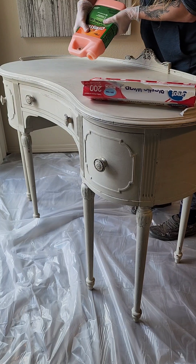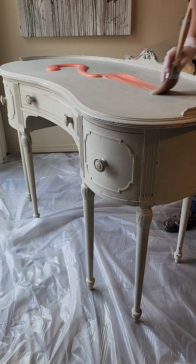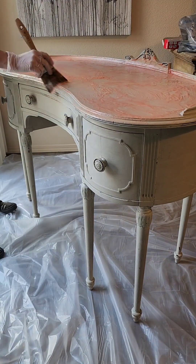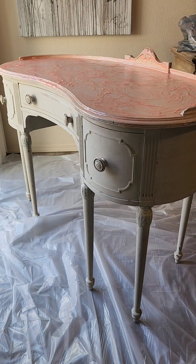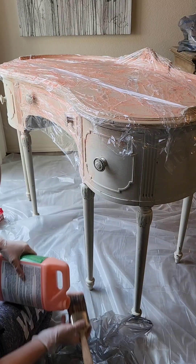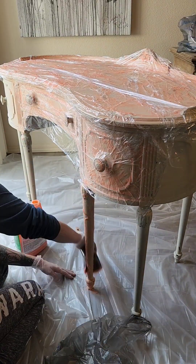The first thing I did was apply a chemical stripper to try to remove as much of this white paint as possible. I'm in Idaho and it's coming into wintertime — about 45 degrees outside — so I laid some plastic down inside my living room to do this. Luckily it doesn't have a super strong chemical smell, but I found out the hard way this is probably one of the worst strippers to use. It doesn't bubble up the paint to fall off; it just turns it into mush and gunk that's really hard to get off.